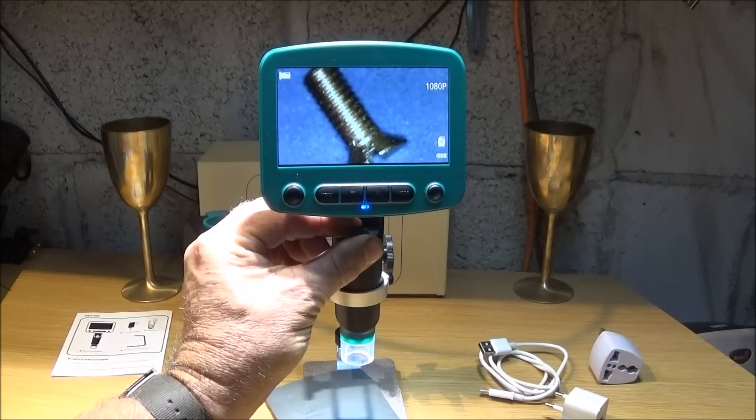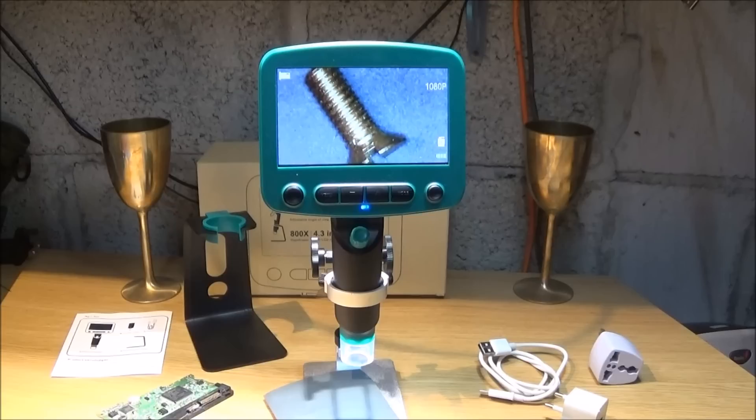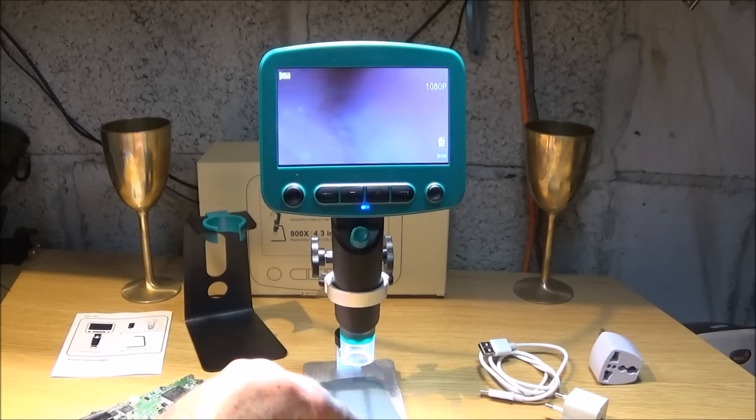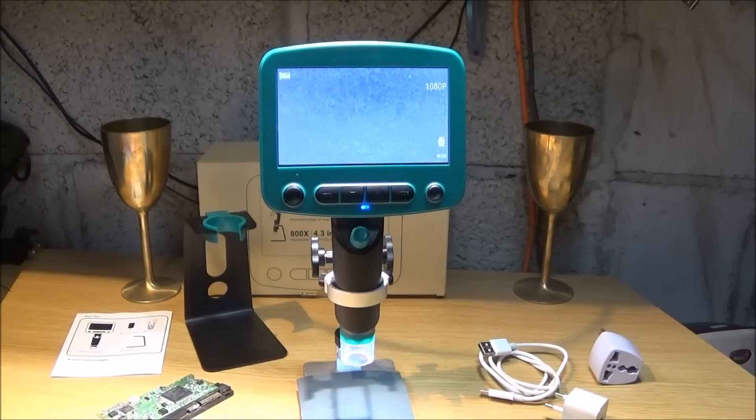There you can see a really good image of those threads. You can actually use it to look at your tool grinding on HSS bits or carbide and verify that the radii are perfect. Sometimes when you look at an HSS tool radius by eye you think it looks fine when it's not.